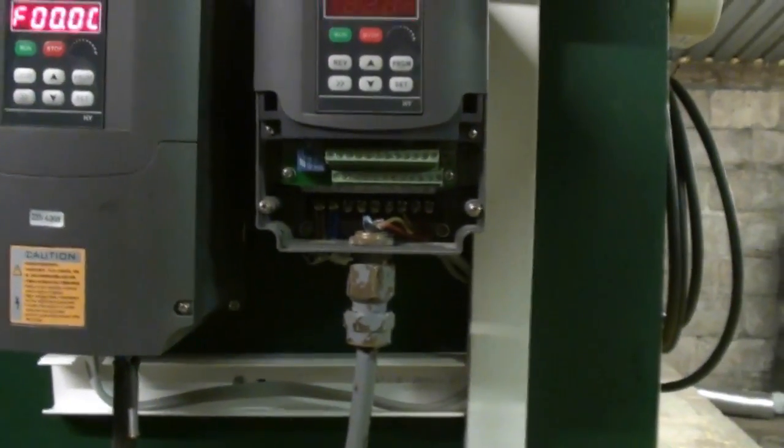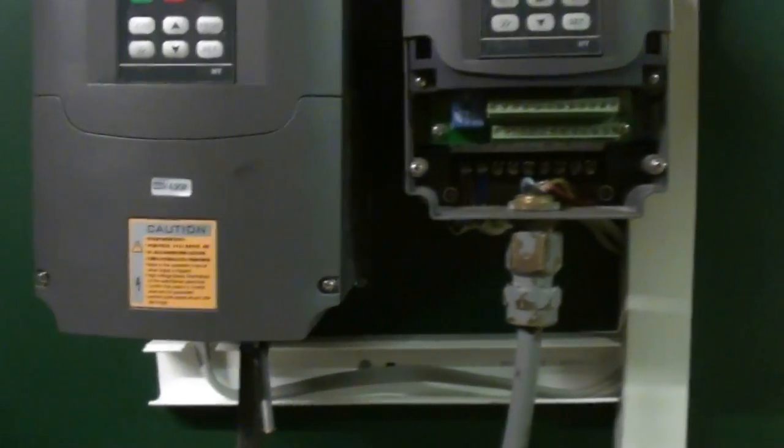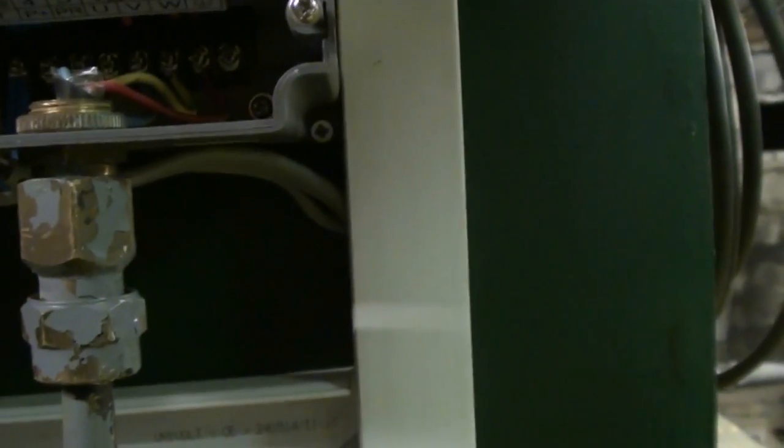The wiring inside is near enough the same on both. You've got 220 in on the left-hand terminals — the wiring here is temporary at the minute, I need to tidy it up but we're just testing it at the moment. Both are identical: you've got 220 coming in, and then you've got your three phases — U, V and W on the end there. The 220 is marked R, S and T, so you use R and S — just live and neutral, normal 240. And the earth terminal is for that. You've got lots of control terminals at the top here — this is all 12 to 24 volt control.